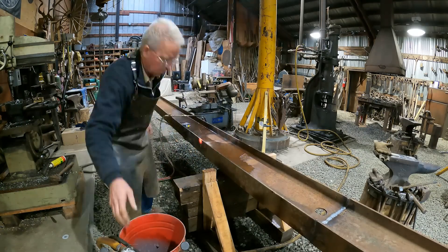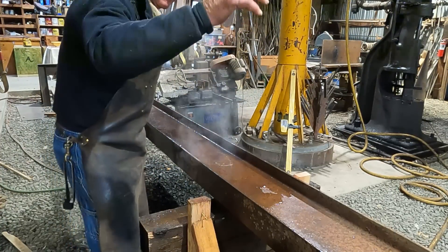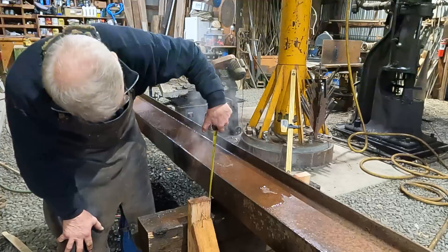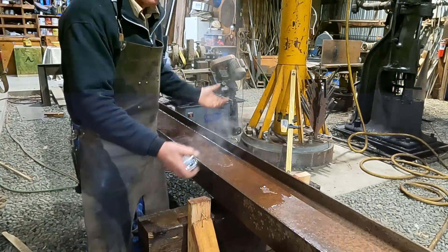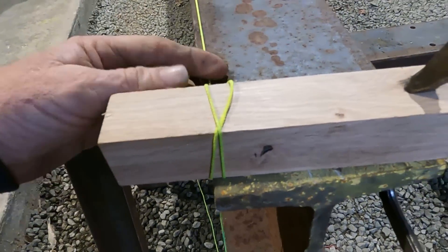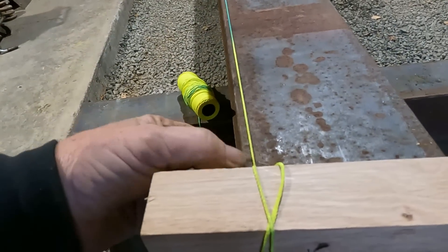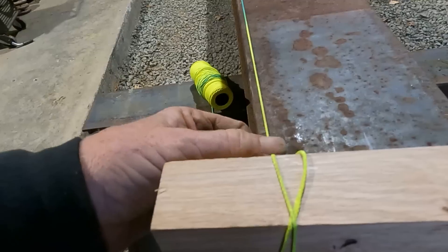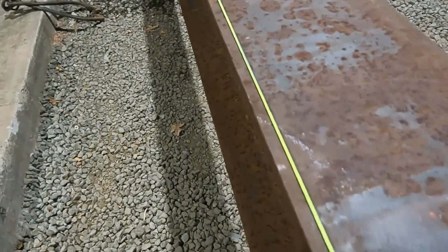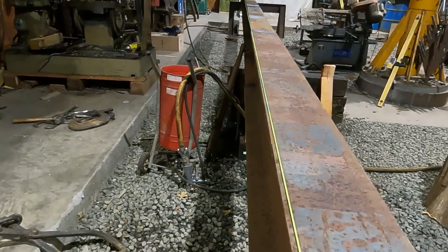Under the weight of gravity — which is probably about 1600 pounds, pushing half on that side, half on this side — we've come down three quarters of an inch. Let's see what it looks like when I unstress it and have it just standing upright. You remember this 14-foot segment was about three eighths wider than the piece I tied into. So I set the string over about a fat quarter inch. And this piece has got a little bit of a bend in it. The string swings over to where it's three eighths, perhaps. And now we're coming up to the splice.